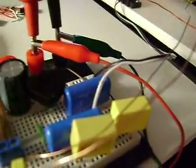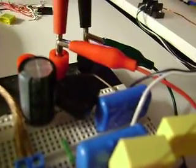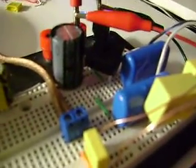Where the secondary comes off of this big coil, each end of that goes through — this first one goes to one side of the bridge input, and this other one goes to this side of the bridge input. Then you've got your positive, which that little green wire under there goes up to that rail, and the negative goes directly to the negative rail.